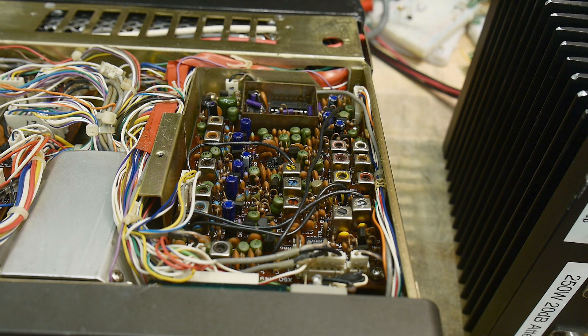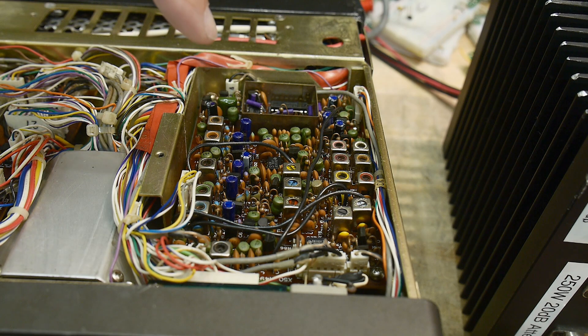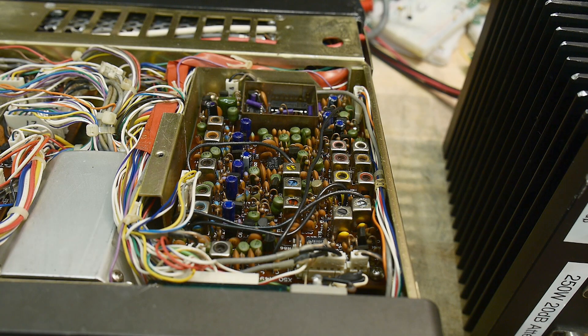When I turn it on, no display in the front, no phase lock loop. But if I just go away, have a snack, come back, it's all working great. He said the way to troubleshoot it is to cool one down — if you cool it down and it dies, then you know that's the transistor that was bad. There are 11 transistors of that type in here, so I'm not quite sure where to start. He probably does, but I don't. We're just going to have to wing it.